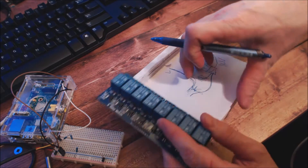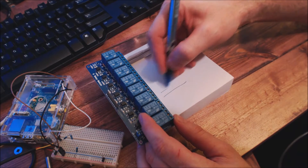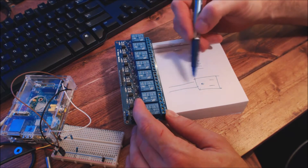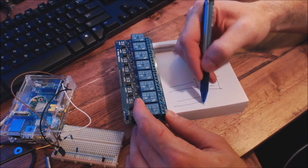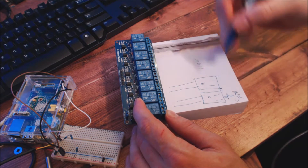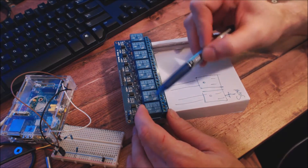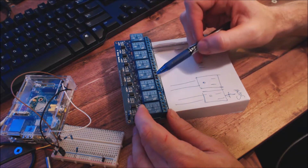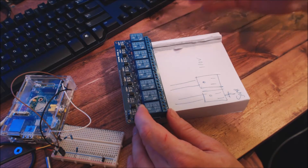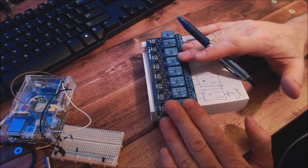The primary purpose of the relays is to have all of them wired to 110-volt sockets. Each relay would be wired into a 110-volt socket. You would plug your sump, actinic light, daytime light, or pumps into these sockets. Each one can be controlled through the jfish system, which based on a schedule will power devices on and off. You can also switch to manual control and independently actuate each relay as you please.